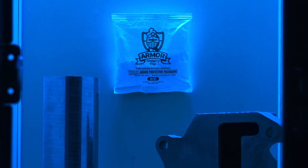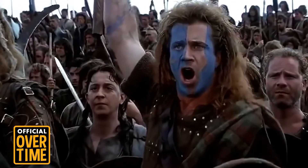It's not just the Armor VCI that puts the 'smart' in SmartyPak — it's the type of desiccant we use too. You've heard about silica gels and clays of the world, and those are all fine and dandy — in fact, we stock those too. SmartyPaks are a specialty desiccant designed to both emit the VCI and pull in moisture, but hold onto the moisture. That is such a key to a desiccant. Think of a sponge: when you get it wet it can hold on, but if you get it drenched it's going to leach back into the environment. Same with desiccants. Our SmartyPaks are kind of like Braveheart — hold the line, hold brothers, hold! It doesn't want to let that moisture go, and that's why it makes it the best option.